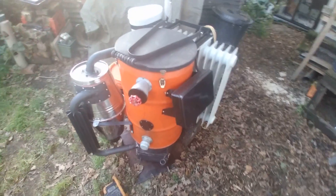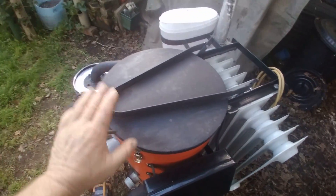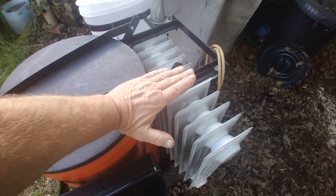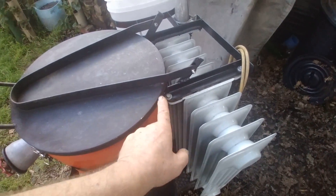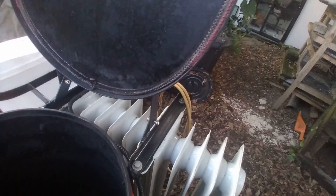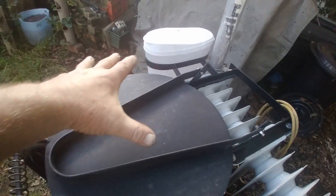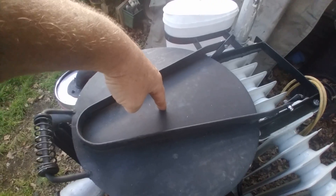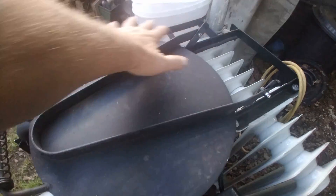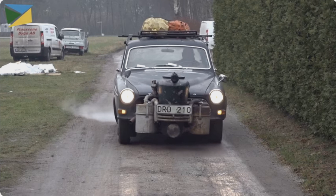One other thing I didn't quite get right is hinging the lid. I hinged the lid but didn't get the pivot point at exactly the correct height to put enough preload onto the smoke-proof gasket around the outside — it's not making good contact and is leaking slightly at the back. My idea is to remove the band across here and make a new hinge arrangement that pushes down with a spring in the center of the lid, providing a nice even self-alignment so that it can pivot as needed and sit wherever it needs to on the lip of the drum.